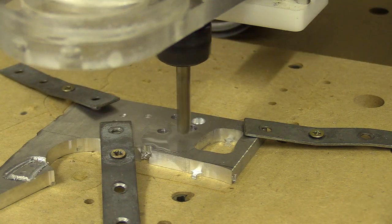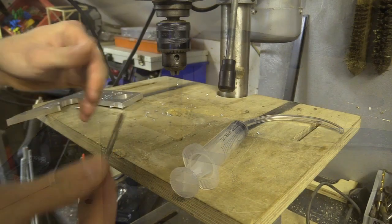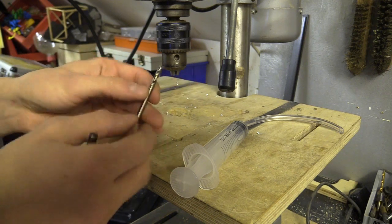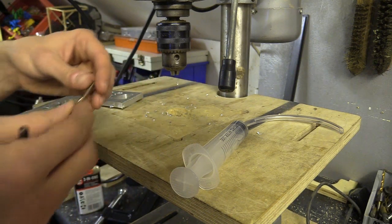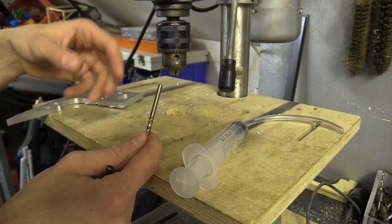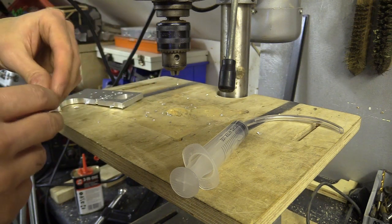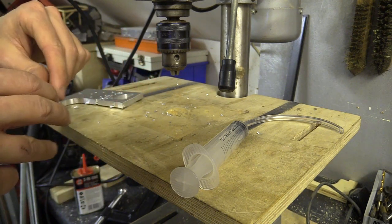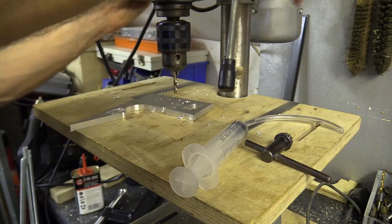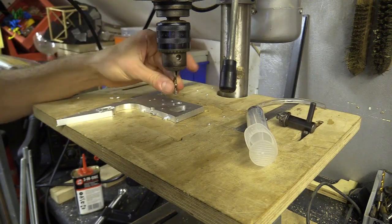I also tried to use the larger stub drill bit to mark out two spots 10mm apart on the CNC machine which I could then drill out on the pillar drill. This is the 4.2mm stub cobalt drill bit that I'll be using. I'm going to use the 4.2mm hole to tap an M5 thread. If I was actually doing this on the CNC plates I would check the bed first with a dial gauge indicator making sure it's nice and level. I drilled the holes out using the 4.2mm bit and the distance between them, which should have been 5.8, was 5.9.